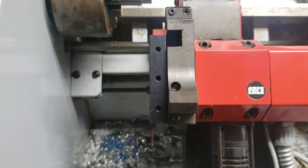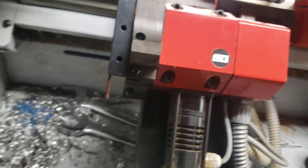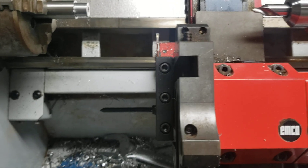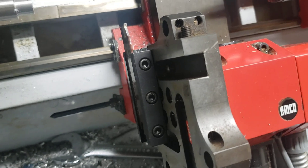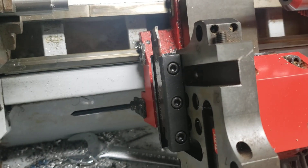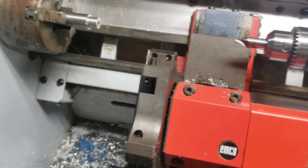I actually did get a parting tool. It doesn't work the greatest, but if I go MDI and call it up, that's tool number four. I got this — it's a Shars. It comes with the block, the blade, and a pack of inserts. I had to get the shank milled down to fit inside the slot. I mean, it works, but the machine does not like it. Trying to find a good cutoff tool for this machine is very, very difficult. You really have to baby it — it's a tiny little machine, so it's not stout.